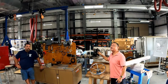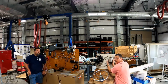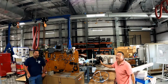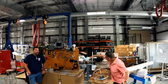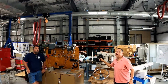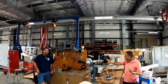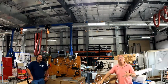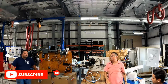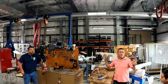This is an electrical power assisted unit, correct? It's installed, look at this. I cut it here, and I install the reservoir. And now I cut it here, and I insert the electrical power assisted unit. Both of them are in series with the system. And after that, the lines enter the actuator. Everybody follow? This is in series. In this moment, no autopilot. I use that one only for extra comfort. It's a power assisted unit because, like Danny says, with 4 outboards, that pump alone is not enough. You need other extra power. Ready?